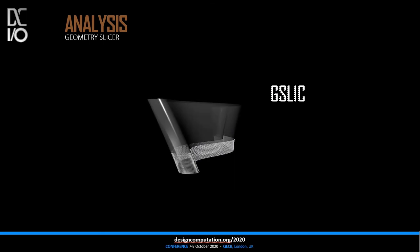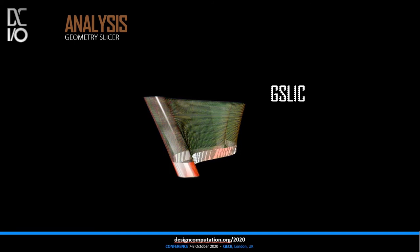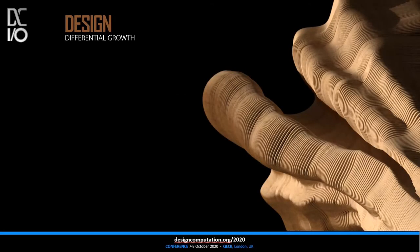A slicer was developed in Grasshopper, which slices an input geometry into its individual layers. In addition, the slicer shows improper design choices that cannot be partially printed. The slicer checks every layer for its occurring curvature and overhang angle, so a designer can check the design before printing. As an output, closed curves or layers are produced. The tests provided valuable results, which were taken into a differential curve growth algorithm in which the curve develops itself within its given constraints and rules.